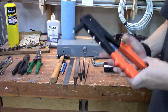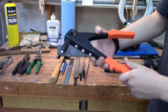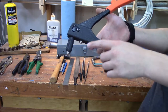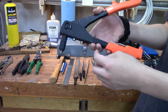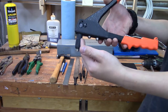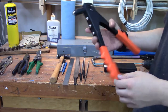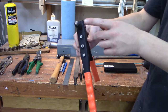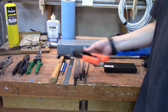Another thing that isn't a necessity — you can just use nuts and bolts if you want — is a rivet gun. A simple hand-powered riveter. It basically pulls up on a shaft; your rivet looks like a little nail with a shank at the top. You put the long end in, and when you press down it grabs the piece and pulls it, flattening the bottom, which then grabs your piece of metal nice and tight. There are different sizes you can use for different-sized rivets.